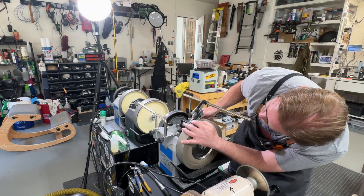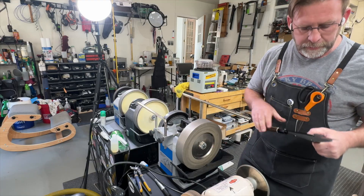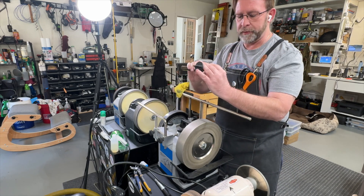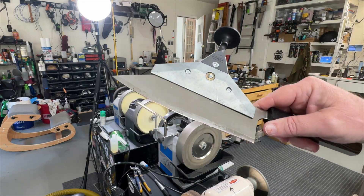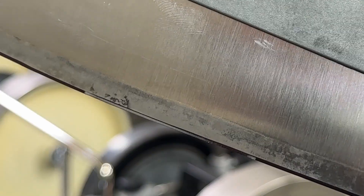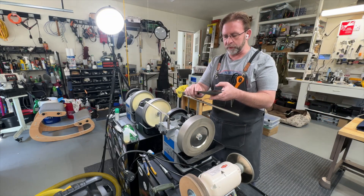We're at 12, so I'm going to go to 13 — just one degree down. I am on 13 now. I want to see how this looks on this bevel. Let me zoom in — you can see where it removed right here, and that looks really, really good. It looks like our goniometer was spot on, and we're going to sharpen this particular Japanese Spyderco knife at 13 degrees.